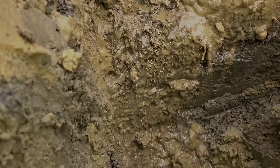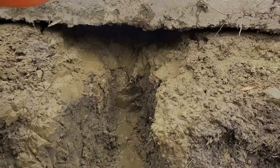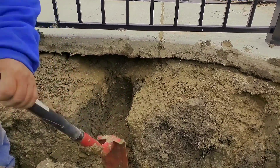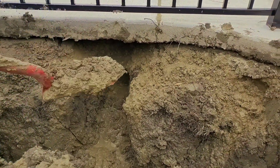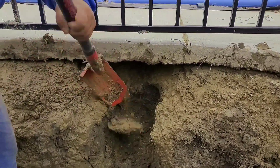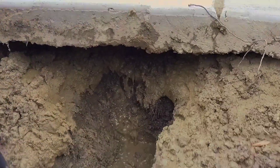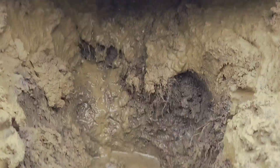I don't care where you're at — warm climate or cold climate — good drainage under your concrete will make it last forever. You do have to buy quality concrete; I recommend 4,000 PSI for a driveway. With good concrete and a good drainage system, you literally only have to do that concrete once. Concrete will continue to harden over time — it's getting harder five, ten, fifteen, twenty years from now. I was told this as a young contractor and thought they were kidding, but that's why old concrete is so hard to hammer out.